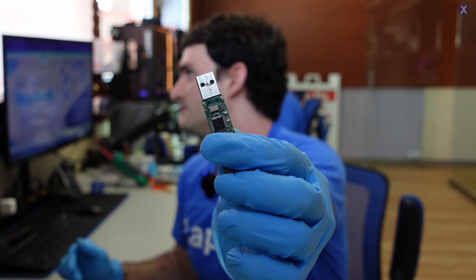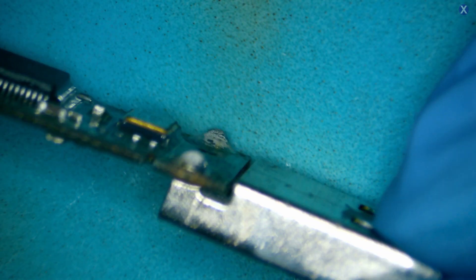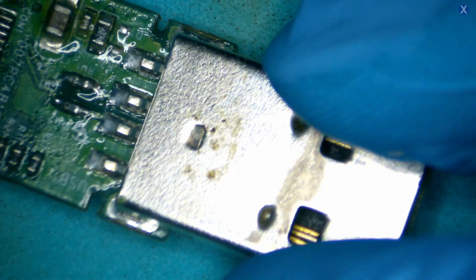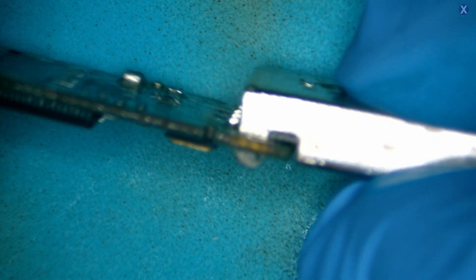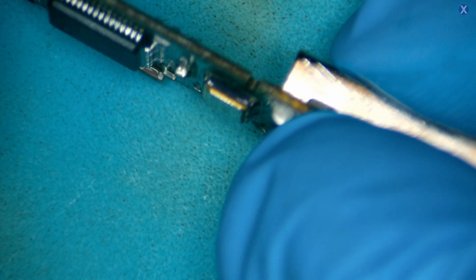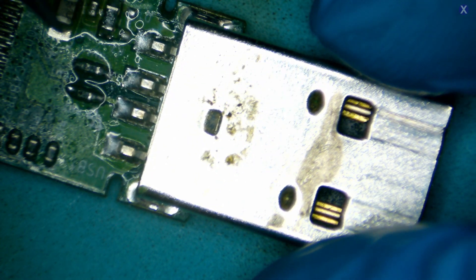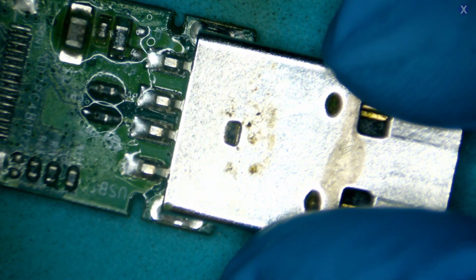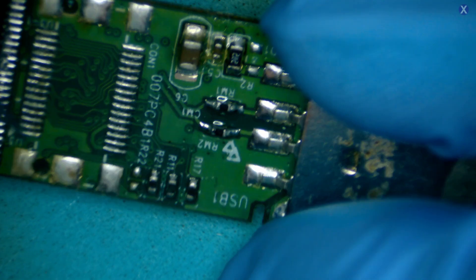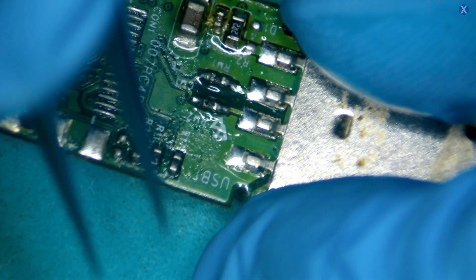The USB looks okay — that connection actually looks to be okay, not too bad. Let's go under the microscope and see if we can see anything obvious. Checking the connection point for bends or damage. The pads look to be pretty good here. The pads are what connect the main USB — a lot of common USBs have four connections with pads — and sometimes the pads can be lifted, which is bad because that's what connects the main USB power and data lines to the board. We also notice some flux here, so it looks like maybe someone tried to fix it — like this was bent at one time and the pads were fixed.